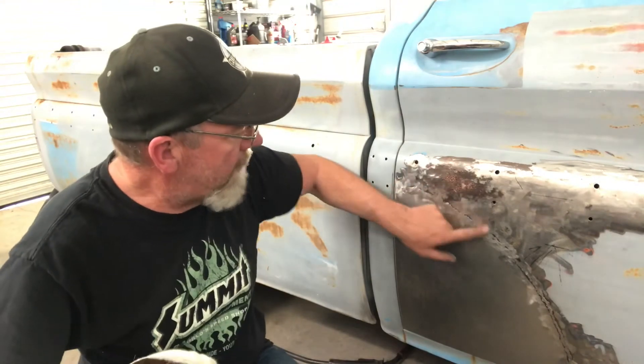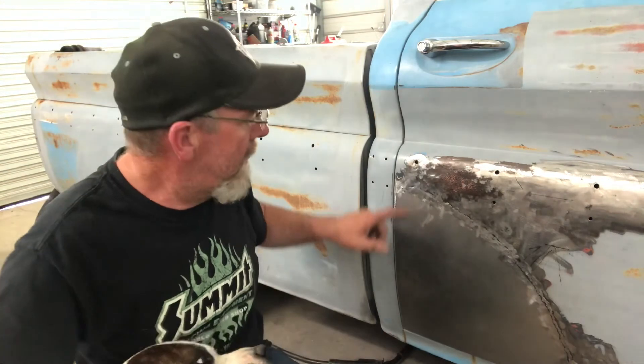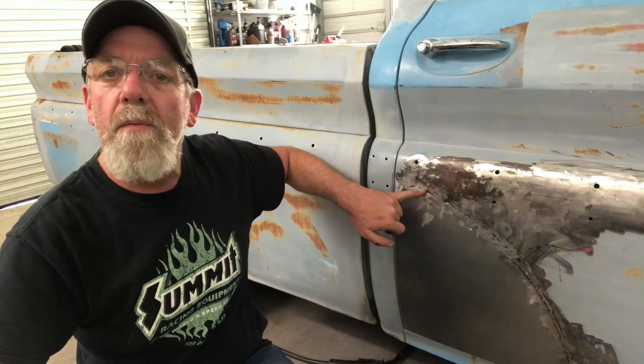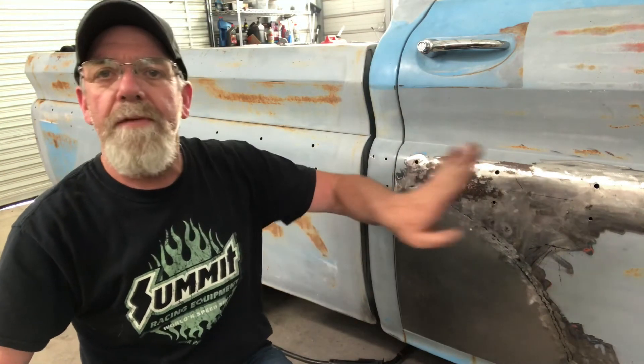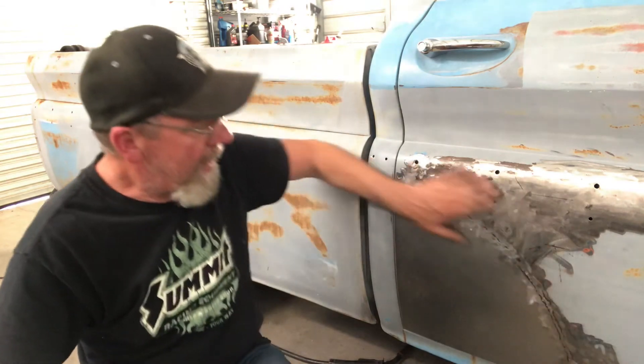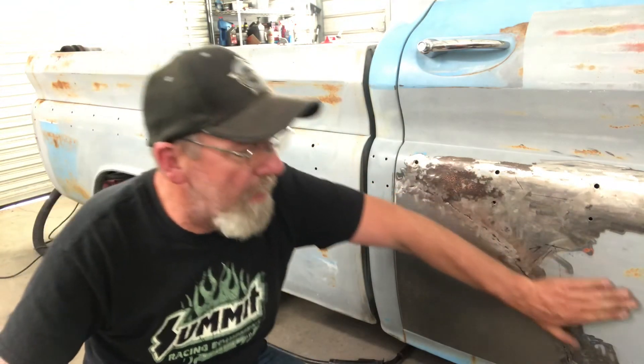That's going to be a wrap on this video. I worked my way through all of the rough spots. What I found was: in the welder, when you flip up the side it tells you heat range and wire speed. For 18-gauge sheet metal, I dropped it down a notch on the heat range and bumped up the wire speed a little bit — it worked a lot better. Also, once I got one spot weld, I just overlapped on that one and laid them on top of one another — do a small section, do a small section — and it came out pretty good. There's a little low spot, but I'll figure that out. I'm going to ask my buddy who cut the panel what I can do about it.